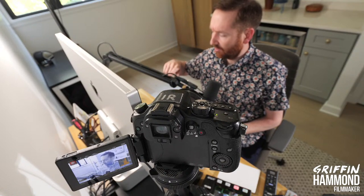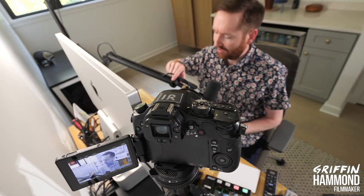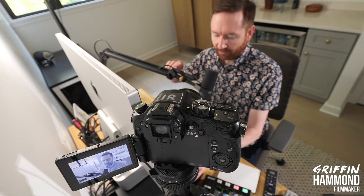Oh, and this is interesting because I talked about how this shirt is a dark colored shirt, but it reflects back as white. But all of these dark things are actually showing up as dark on the infrared. Although I do find this a lot, you kind of see it here. To the eye, this plastic part of the arm is the same color as this, I guess this part's metal. But I see this a lot in infrared, that it shows up as many different colors. This looks like one color, this looks like a different color, this knob looks like a different color. Because this is plastic, this is plastic, this is metal. So they're all reflecting infrared back in different ways.